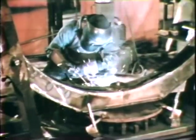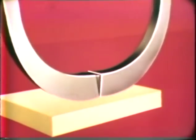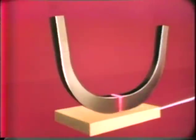Another adaptation of rule number two is the spacing of parts before welding. In welding these searchlight trunnion arms, which must be very accurately spaced when the welding is completed, allowance is made for the amount of shrinkage which will occur. Before welding, the parts are spaced like this. Then, when the welding is completed, watch how controlled shrinkage brings the two arms into correct position and perfect alignment.